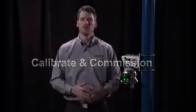For the start of this step, it's very important that you bypass your system. Make sure you disable all alarm and fault outputs. And it's also a good idea to check and make sure that you've cleaned your lens and that there's no obvious contaminants on there. What we need to do is complete our zero calibration. Now there's no span calibration for the LS2000. We just need to teach the device what its normal zero looks like.